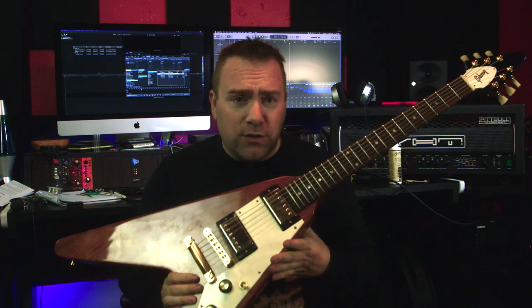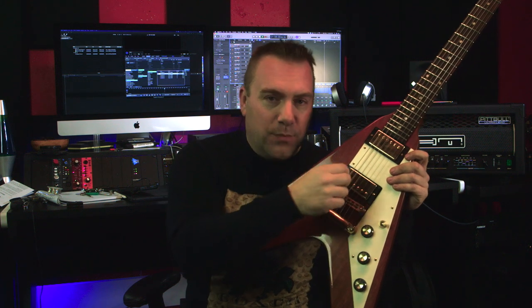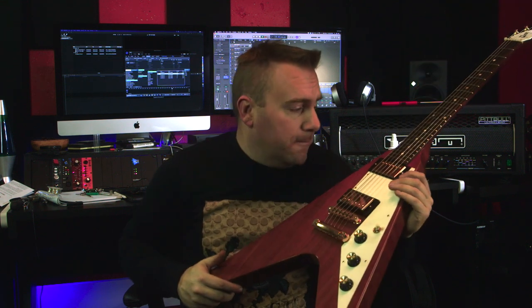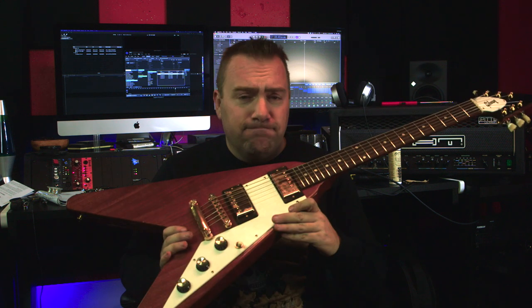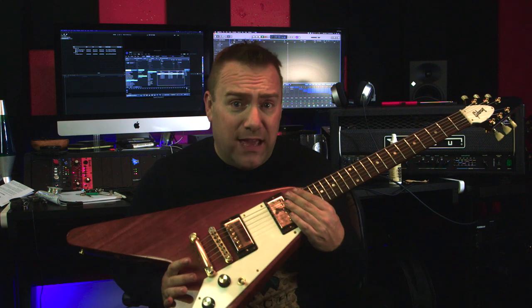Again, it's a very simple procedure, very easy to do. You just have to make sure that the pole pieces fit through properly and are actually in all of the grooves. If one of them is not in the groove enough, it could be that the pickup cover is not meant for that pickup, or you just have to raise the pole pieces a little and squeeze and use a clamp — it will go through if it does fit. And you're off to the races. Thanks for watching. Now excuse me, I have a whole ton of candles to throw out.